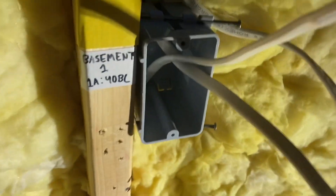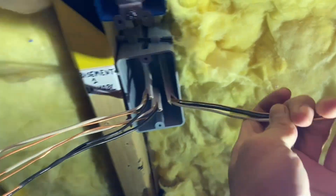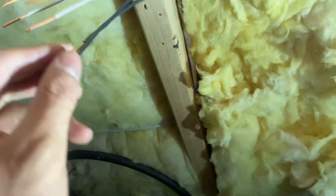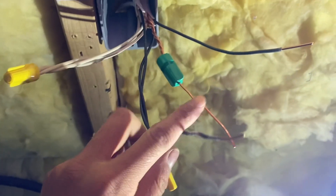With these boxes you basically just grab something and then nail them into the side of a stud. So I have the box mounted and the wire pulled. This is the wire going to the panel and then this is just straight power. What I'm going to do is splice all the neutrals and grounds and all that together, then splice these two hots together and wire those two to the switch so that when the switch is connected and disconnected, I can turn the panel on and off. I did add just a pigtail here so I can connect it to the switch easier. So now I just have to tuck the wires back and then connect these three cables to the switch.